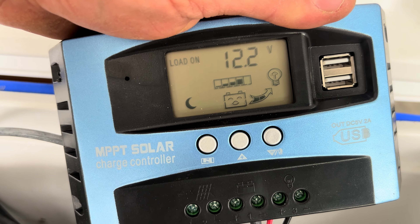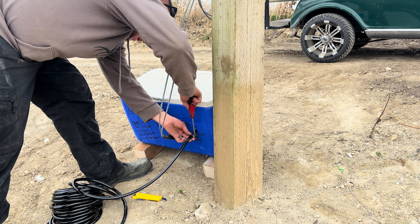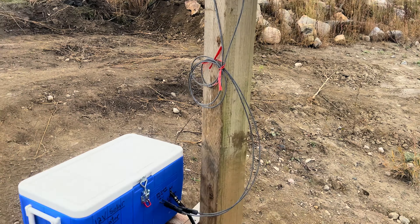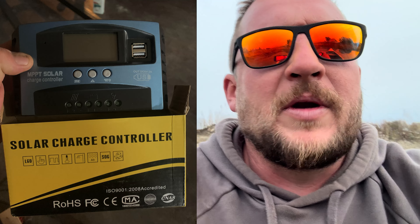I have a bung open so it can draw air. I did quick connects to the outside for positive and negative PV solar input, and a quick connect for the weighted airline. Off Amazon I had to buy 100 feet of weighted airline — about 90 bucks. That pump was about 70 bucks. I'm not sure how long it'll last being such a cheap DC pump. Some people say go to AC, but I didn't want to invert the electricity — I wanted to keep it DC. The charge controller was 20 bucks. I had the Coleman cooler. AGM battery was $99 plus a $50 core.